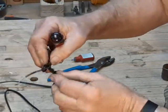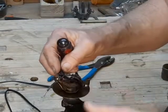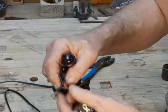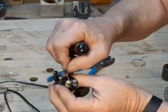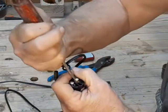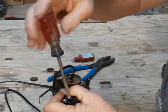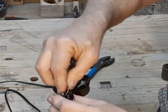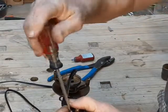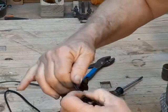So, as I've always said, on a lamp cord, one side has ridges, one side is smooth. You can feed them with your fingers. The smooth side always goes underneath the brass colored screw. Just loop it underneath there clockwise, because when you tighten it down, that will draw the wire in. Same thing on the other side. The wire with the ridges goes on the silver wire, the silver screw. And you draw this all up close.